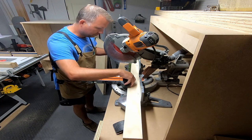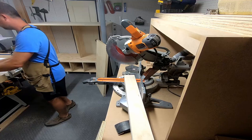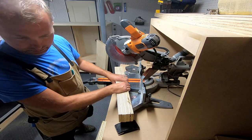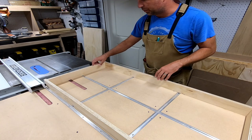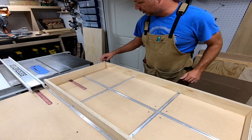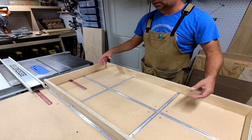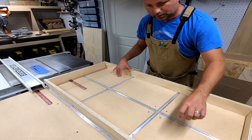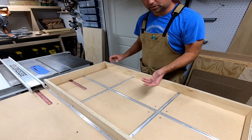That's 47 inches for the sides. The front pieces will be 21 and a half inches. The leg pieces I'll set aside for now since I'm not sure of the length yet. So when everything's cut, you end up with a rectangle box of side pieces — the front-to-back pieces inset about half an inch. The top goes on top, screwed up from underneath. The legs fit inside, and inside those legs will be another system — the cup holder — that swings all the way around and comes back up at a slight angle.